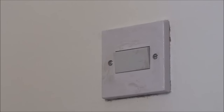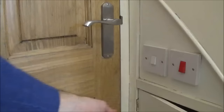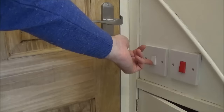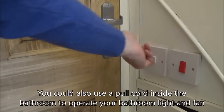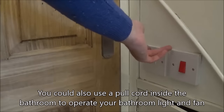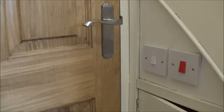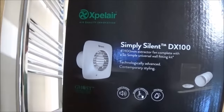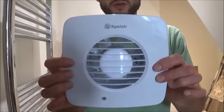With the standard light switch and the three pole fan isolating switch turned on, turning the light switch on turns the fan on inside the bathroom. When you turn the switch off, the fan will run on for about 30 minutes on the timer and then turn itself off. The fan being used today is the Xpelair Simply Silent DX100. This fan has a timer which means it'll run on when you turn off the light switch.